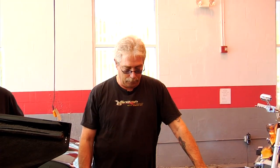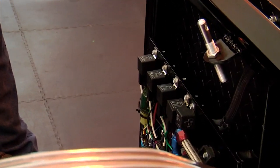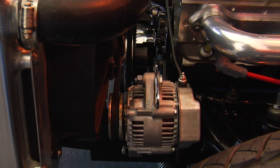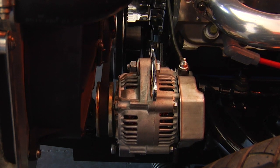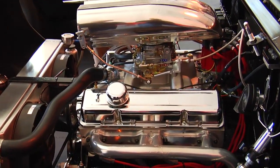To make it cool we went with a Mustang II tubular front end — all lightweight, very easily done. The wiring is basically the heart of the whole wiring harness — it's just relays; we don't have fuses in the system, we run everything off relays. The exhaust is completely one-off — you don't really see an exhaust like that, but we had to do it because of clearances. We're running a 100-amp mini alternator which attaches to the frame, not the motor, since the motor is solid mounted. The water pump runs directly off of it, so we're only running two belts — everything's loomed in, very easy to get to, very clean.